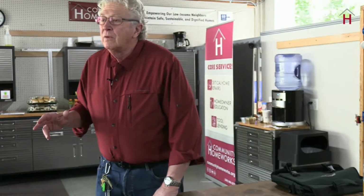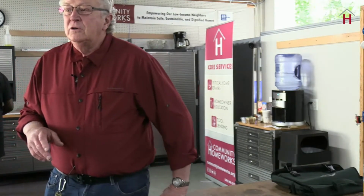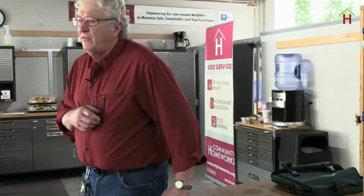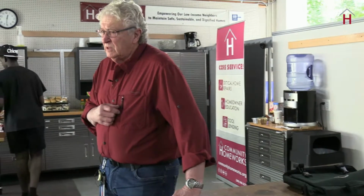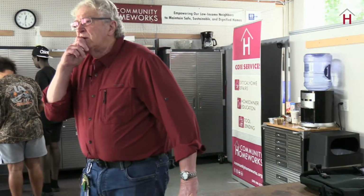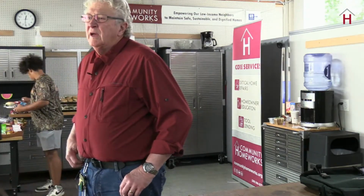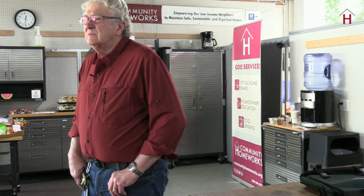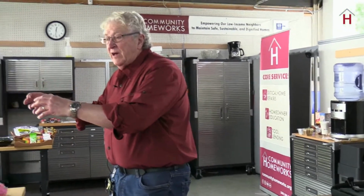All right. Good afternoon, John Hunter. Please tell us about programs where the utility company can remotely turn down the heat or air conditioning. Do they have it here? I think we have what they call the smart electric meters. Is that what you're referring to? Well, yes, in times of excessive electricity demand, utility companies do have a smart meter. They can reduce your electric flow. In addition to that, if you have one of these communicating thermostats, in those times they can turn down heating or air conditioning, if it's compatible to where they can have control of it.